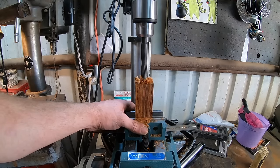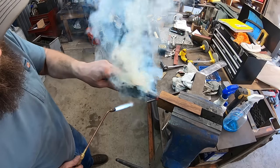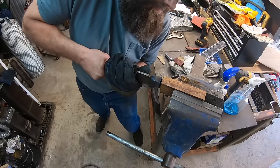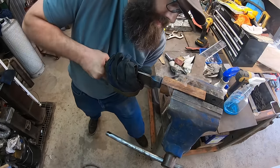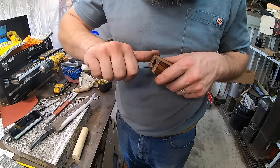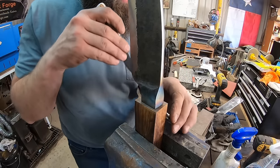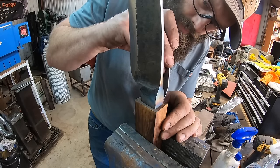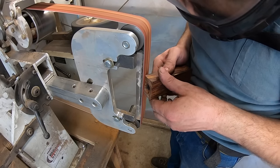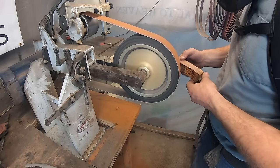Using a piece of desert ironwood for the handle and doing a step drill system — I'll use a 9/16ths drill bit to go about two-thirds of the way, and with a smaller drill plus a little bit of the burn-in technique, I have a pretty graduated hole that fits the taper on the tang fairly well. Once fit up I'll use epoxy to completely fill that void around the tang for a good secure fit. I kind of tried out a museum fit but didn't really set myself up well for it in this case, so I ended up not going with it.